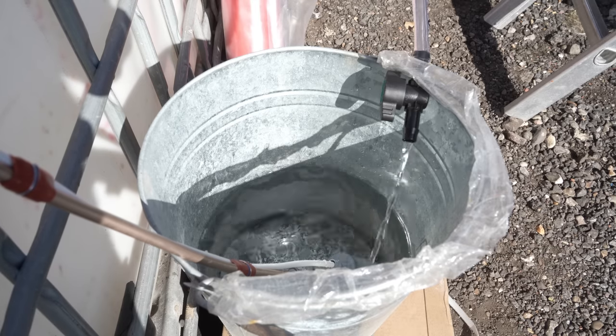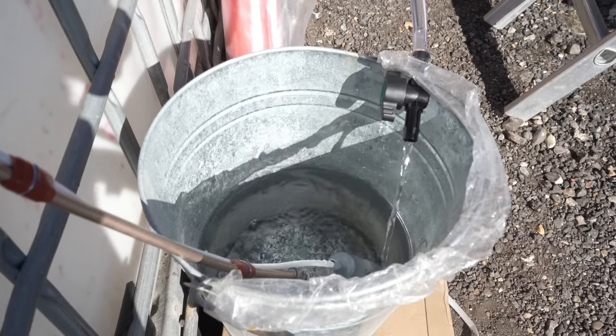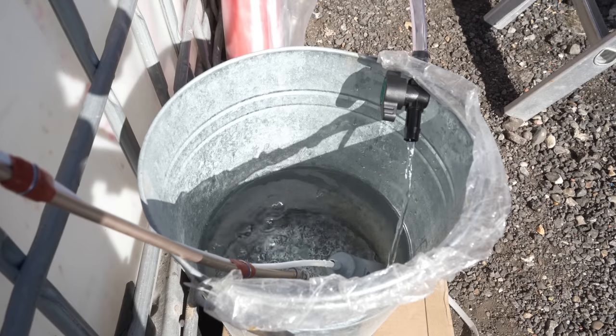I thought I might need to throttle the flow, but the dense, compacted nature of the carbon block filter, plus all the hose diameter adjustments, mean much of the pressure is lost. Rather pleasingly, it's almost exactly the controllable water flow rate I wanted once the trapped air bubbles are expelled. The carbon block can deal with pressure from a larger pump, but this will do for now.